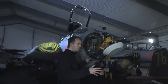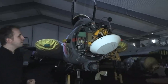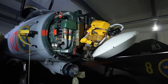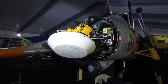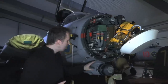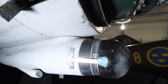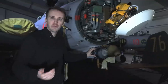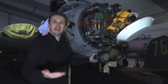On the Draken, we would normally have the radome here with a pitot tube, but that has been demounted on the J variant, giving us a fantastic look at the PS-11A radar set. Draken has different radar sets depending on the iteration — this is more or less the last radar set used on this aircraft, and it operates in the X-band. Then there's this little bulb fairing down low — that is the Hughes N-71 IRST, infrared search and track, which allows you to detect and track infrared objects, generally a heat signature.